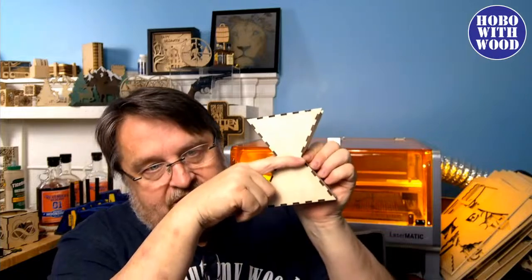But that representation, seeing that pre-focus, so depending on what your spot size is on your laser, you'll need to go to your laser specs if you don't already know them. And it blew my mind to listen to some of the people in the chats say, oh yeah, my spot size is this, my spot size is that. And I'm like, well, only after a week of playing with this nonstop have I got this committed to memory, that it's 0.35 by 0.22 on max power on the 30 watt. The 10 watt.